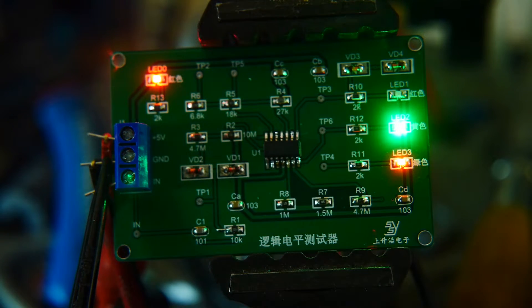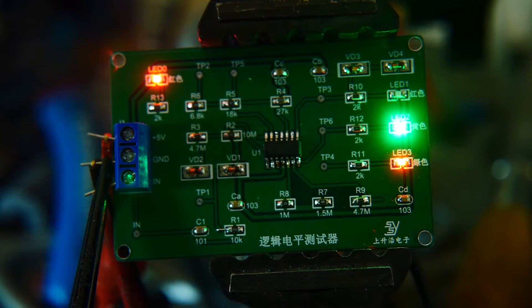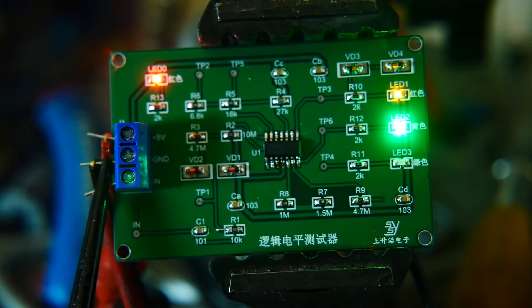If we're here at ground, the red light comes on. As we start increasing voltage, it goes off right around 0.7 volts — the diode drop. Keep going up, and that top light starts to light right at about 2.4 volts. So from 2.4 volts up to 5 volts, the top LED lights. It does work.